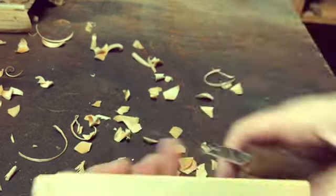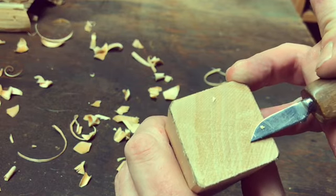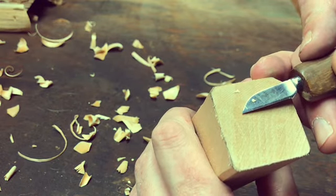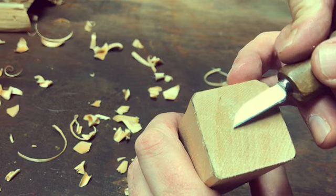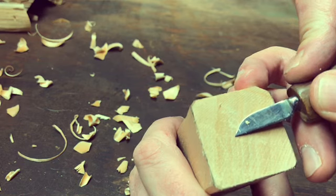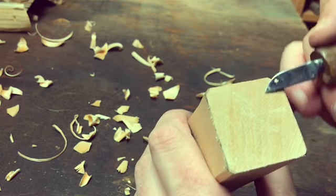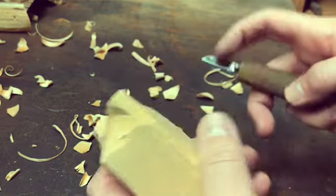Yeah, the growth rings are basically, the trees are going to grow much faster during the summertime, and so that's where there's more space on a softwood tree, which is like a Christmas tree or a pine tree. You'll see that it's porous, and you'll feel that in other woods as well. It'll be not quite as good a detail. Where it's denser is the winter time. The trees don't grow as fast, but they still keep growing, so it becomes more and more dense. And so there's other factors that affect the tree growth, what it's eating, maybe it's genetics on how porous and dense it might be outside of summer and winter.